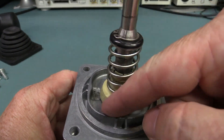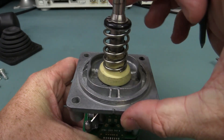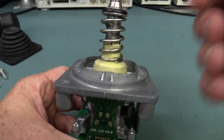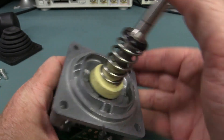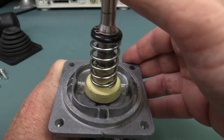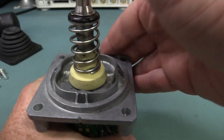And of course this being around in here obviously just slides in that slot there real easy, so it stays on target unless you really have to put a bit of force to move it over. That is terrific stuff. And of course the force is determined by your spring on there. So if the customer says the joystick's a bit stiff, they can just change the spring and give the customer whatever they want.